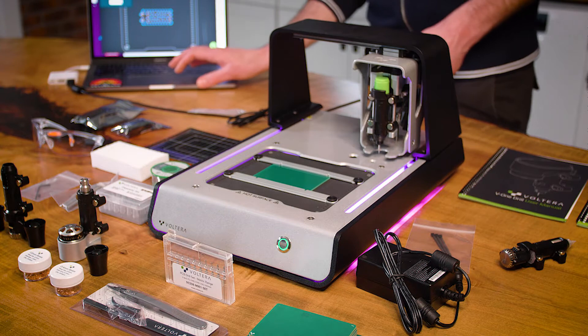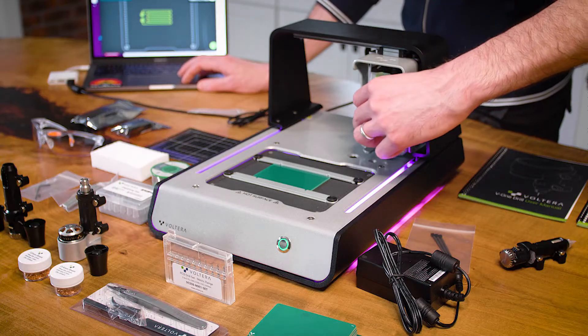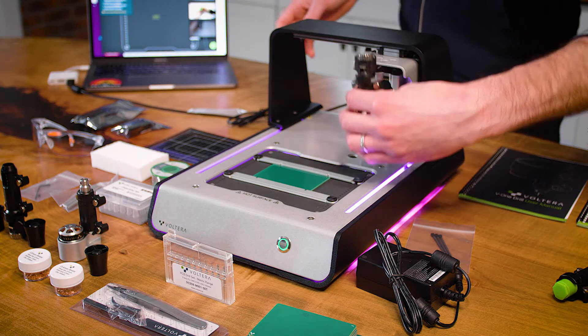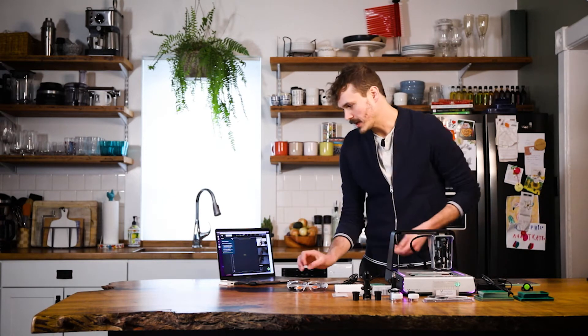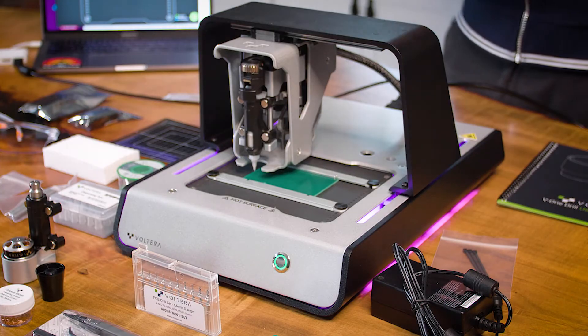Probing's done. The software now has an accurate height map of the substrate we're about to print on. I'm going to remove that probe. Next, it's telling me to prime the conductor. I did that ahead of time just like a cooking show to save time. It's already primed — just a quick turn by hand until a little ink comes out, then you turn it back a quarter of the way. Now we print. Looks like this one's going to take just under 12 minutes.